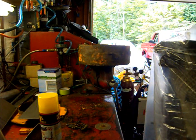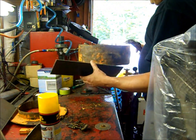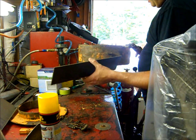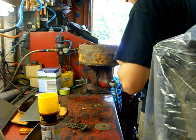We're going to use the plasma cutter to chop some of this bent up metal out of here. I have this nice piece — this is 16 gauge, I believe this is 11 gauge. Since we had a blowout on the bottom here before, I'm going to patch in a little heavier piece.